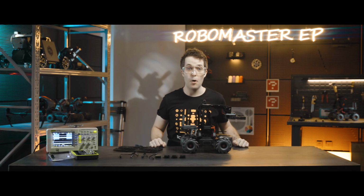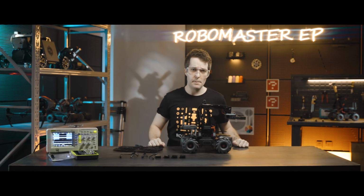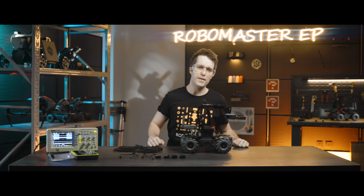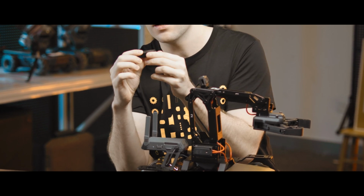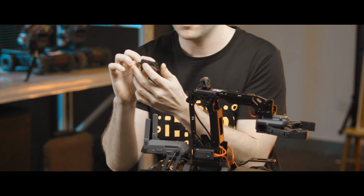Now, we're going to mount the sensor adapters. It is recommended to mount the 4 sensor adapters to the 4 corners of the robot chassis extension platform and then fix each one in place with 4 screws. Make sure the select button is on the outside and the 2 ports face inward.